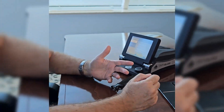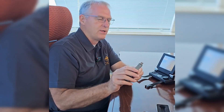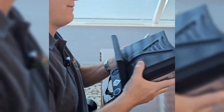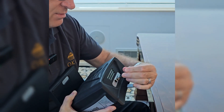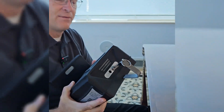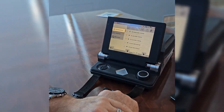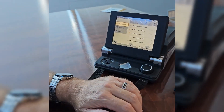The next step is to connect the USB drive. You can use a blank drive or you can use the drive that comes with your OKM equipment — this one has your Visualizer 3D Studio software on it. You can use this drive. You plug the drive into the back of the unit. Now the drive is plugged in. The system will recognize it, and if we come back to the control screen, you can see that the USB drive is now selected. This is a scan that we did yesterday.